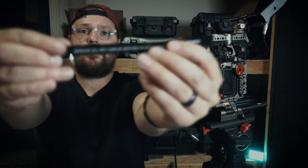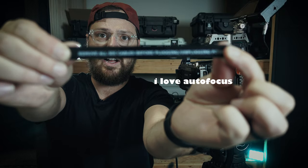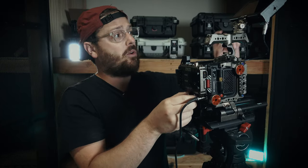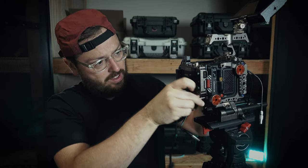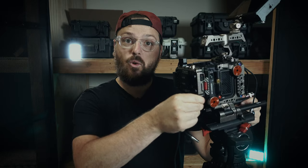Where this also comes in is unplugging power — SDI also has to be disconnected. Remove all SDI cables before plugging or unplugging power. So before we unplug this, we are going to unplug all SDIs first. Once our SDIs are unplugged, we're safe to unplug here and here. The SDI is the thing that's going to complete the circuit and screw up your issue. Always make sure your SDI cables are off when you connect power or disconnect power.